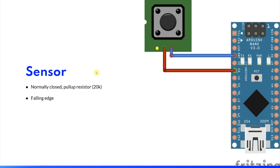The next part was crucial to get right. The development board spends most of its time in deep sleep mode, conserving energy. Only a few pins are capable of being defined as interrupts to wake the development board from this mode. The micro switch has two configurations, and I used the one called normally closed. This means that normally the microcontroller will be sleeping and the lid will be closed. This leads to the micro switch being depressed and the switch circuit will be open, that is not completed.